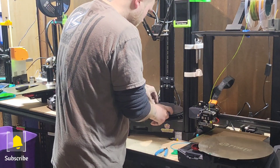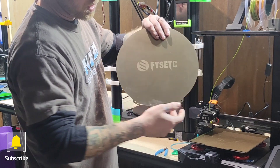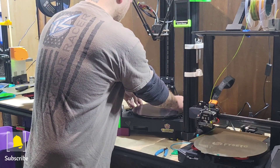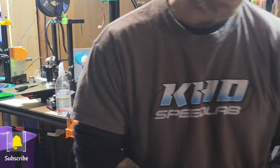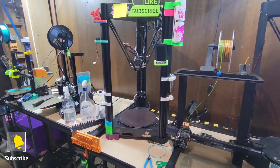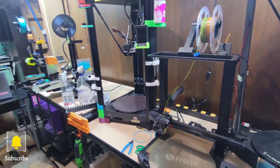After you've cleaned the glass with alcohol, make sure the tabs are in the front on the stick-on magnet, then stick it on. When I first started printing I was scared of it, but it's straightforward. Please like and subscribe — that's how you put on a PEI build plate on pretty much 99% of machines.